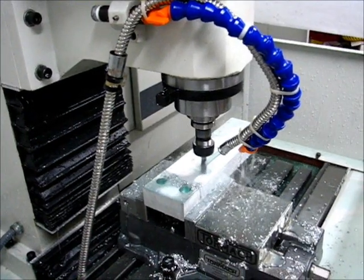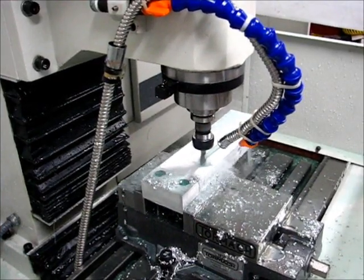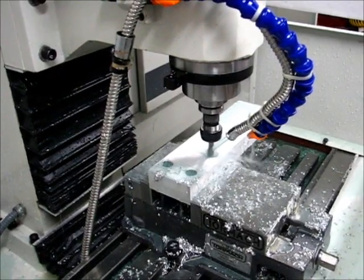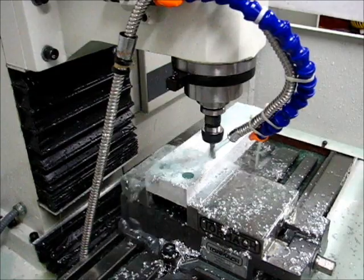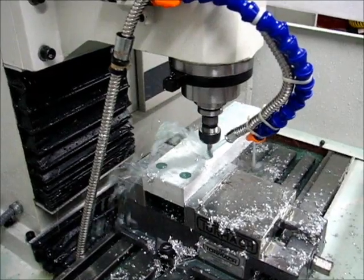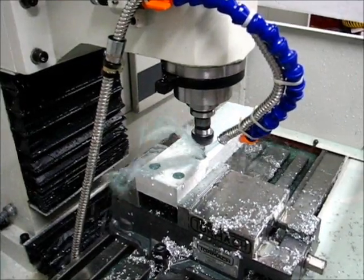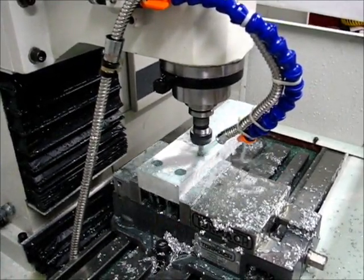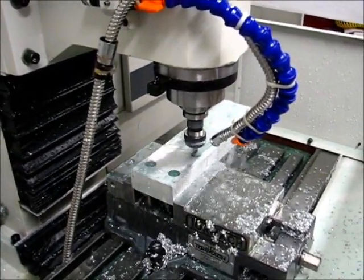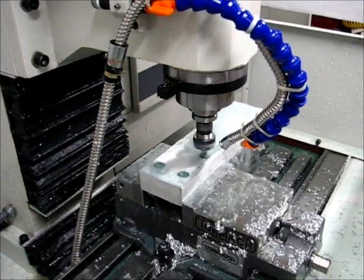This is noisier than I was expecting it to be — not a big deal really. Another thing I forgot about was that some of the holes were going to fill with chips. It's not exactly going to be positive for the finishing operation that occurs next. I guess what I may want to do in the future is mill the pocket and then finish the hole, so it doesn't have an opportunity to fill up with chips. I'll have to take a break here and make sure I'm ready to clear chips before the finishing operation starts on the next hole.